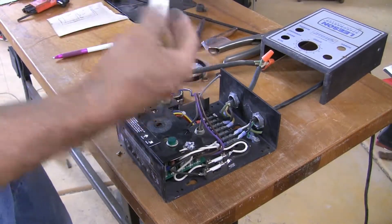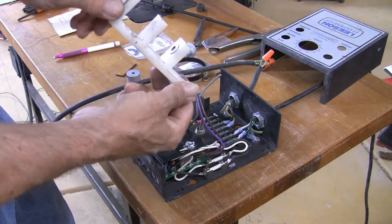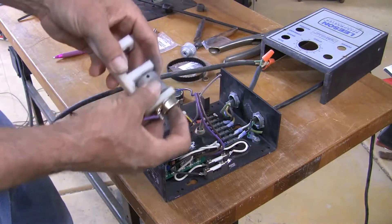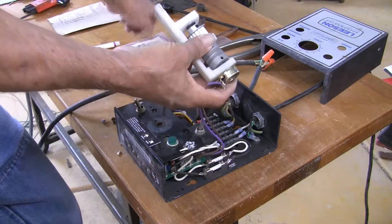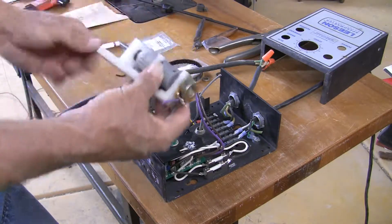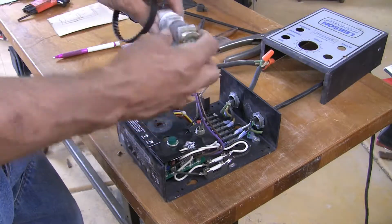Here's where we're at - we carved this thing out. We could have used pretty much anything to carve it but I used the mill. I put bearings in my two sockets. It's going to end up looking something like this - the potentiometer goes here, the cog fits in the middle, and a shaft is going to join it all together going through there, through there, through there. Then we're going to have the belt on there, and that's going to be attached to the linkage. It's going to do something like that once everything's locked down.